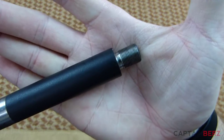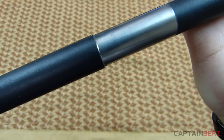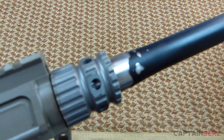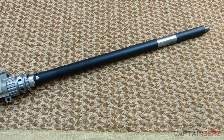Let's take a closer look from the threads back. You can see the threads, it tapers down to 3/4 inch for the gas block, then tapers up to 8/10 of an inch, and then back to the chamber. All in all, I really think this is a great barrel. There are lots of great barrels out there and this one is around the $250 mark. If you're looking for a precision SPR-type barrel at 18 inches, this is definitely one to consider. Nordic Components is known for making great stuff and this barrel is no exception.